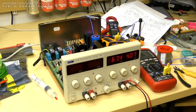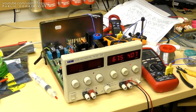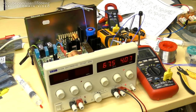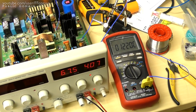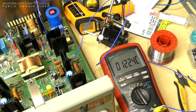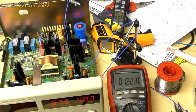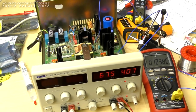All right, and I think I'm starting to calm down about the resistor situation because I've got it back in the case. I've had it loaded down rather close to the maximum output this thing can achieve. And I also found another similar resistor, similar wattage, on the secondary side, which is running just as hot under heavy load. So I really think the behavior we're seeing on the primary side is normal, and this thing is just built to run rather hot.